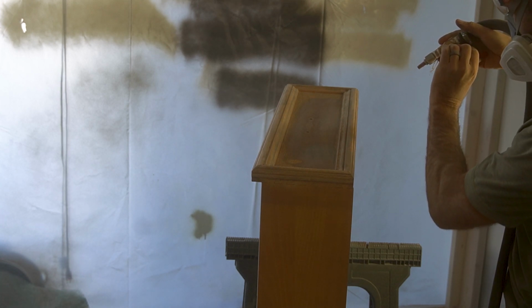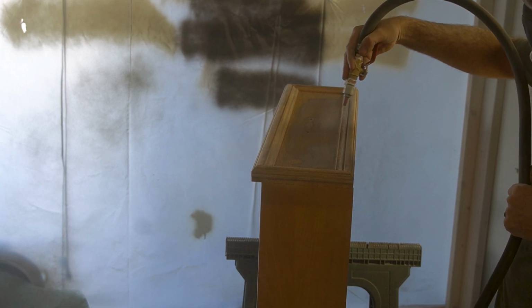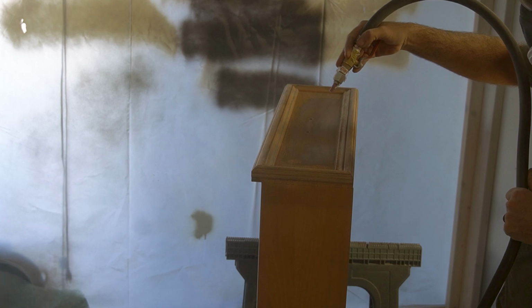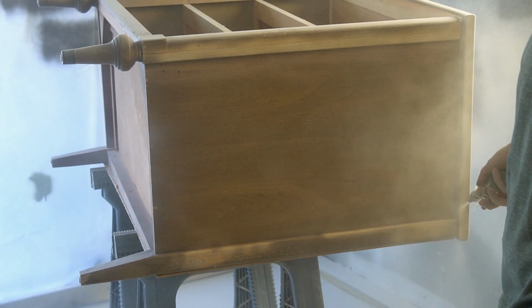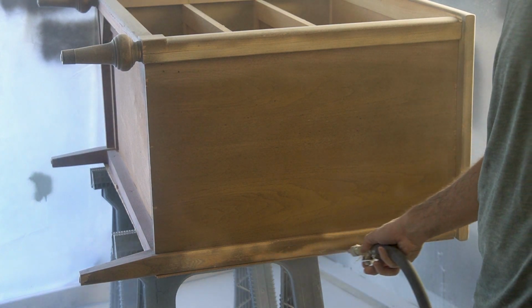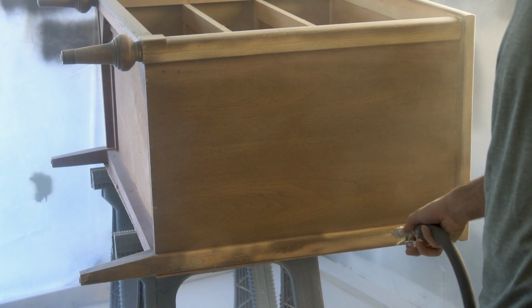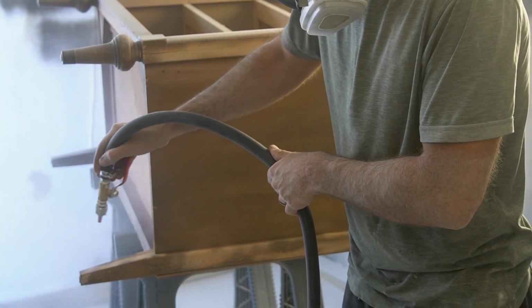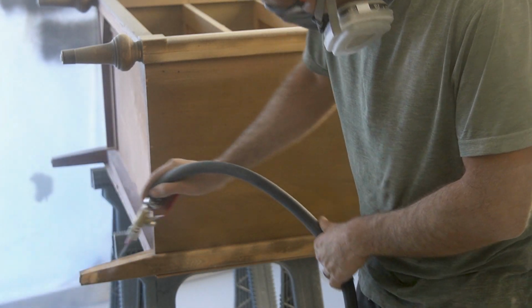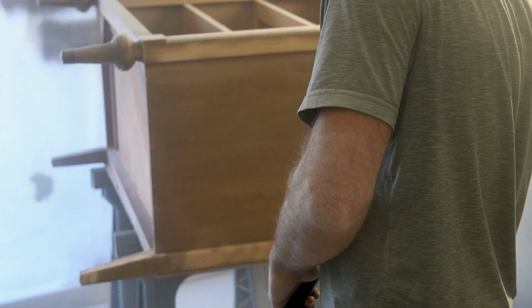I'm no abrasive blasting expert, but I've been doing furniture restoration for a little while now, not long enough to be an expert either. But generally speaking, for the process you need to follow after you soda blast, I really like to vacuum everything because I feel like it's better than blowing it off. As opposed to pushing more of the contaminants into the grain, it pulls them out.